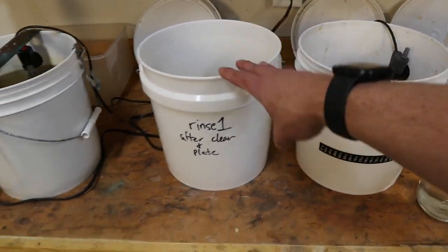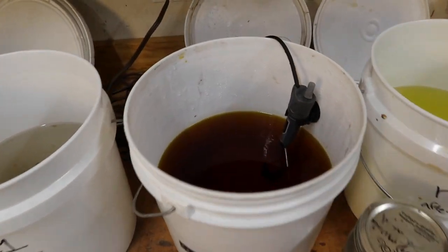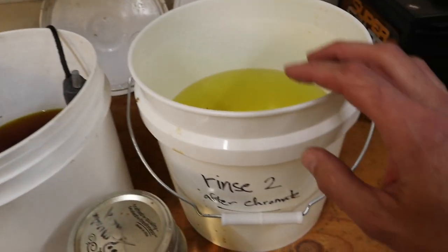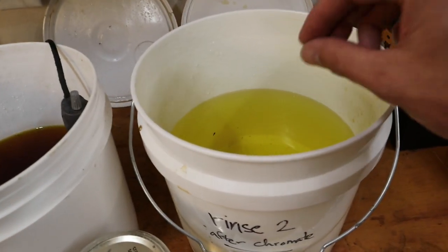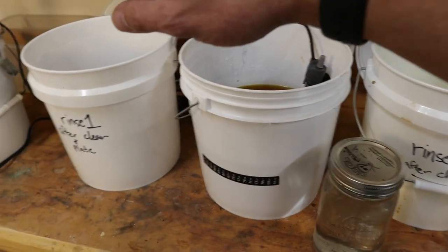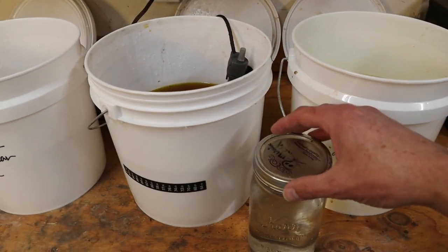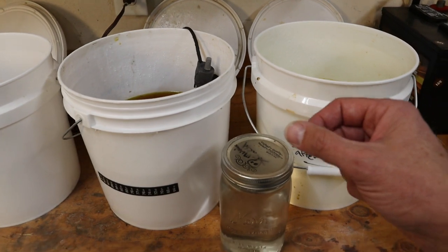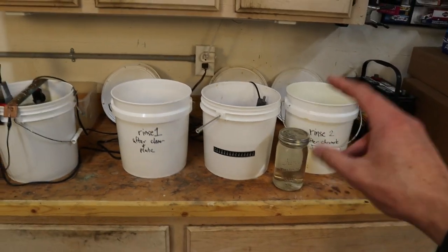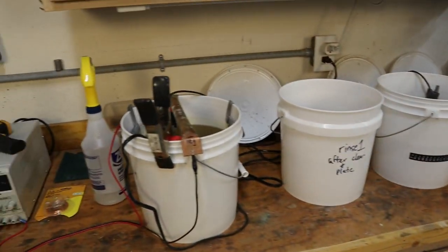You're going to have a rinse pail for after plating. This is our yellow chromate bucket with the second aquarium heater, which keeps it around 80 degrees. Then you have a final rinse bucket to get the chromate off the part after dipping. We also have a clean hydrochloric acid bath — that's only for after plating to do what's called a bright dip or pickling the part. That eats a very tiny bit of the zinc plating prior to going into the chromate, giving it an etch so the chromate adheres better. Once done with chromate, hang your parts on a ladder with a fan blowing on them to dry.